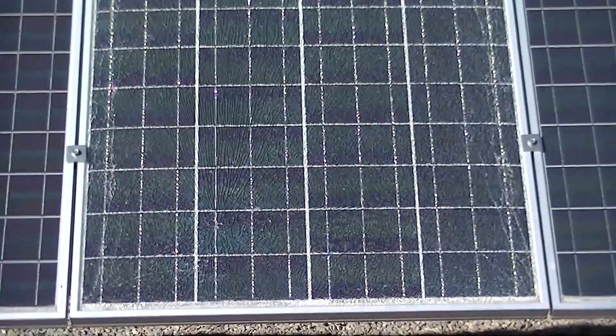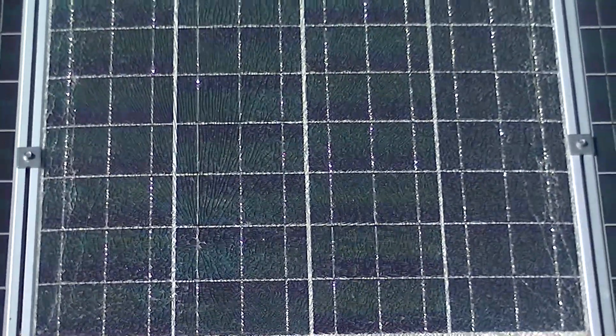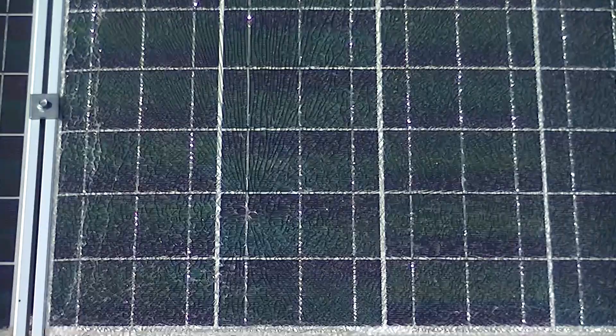Going down to the lower side of the clamps, you can see a lot of shattering around the clamps. But if we zoom in a little bit further, we get a clue as to why this solar module shattered — and it's right there. That is called the butterfly effect in the solar module, and you'll notice it's right above the electrical busbar of the solar cell.